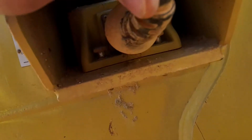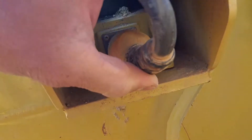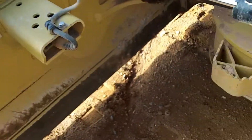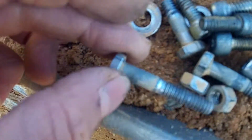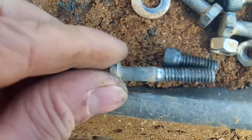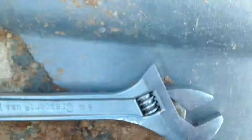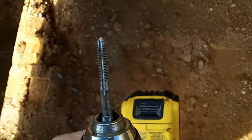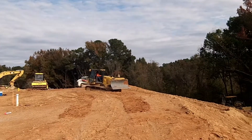Right now it's sitting flat, so that's interesting. We'll fix that for them, then we'll figure out what the GPS issue is. They boogered it up a little bit — those holes are aluminum. They used these instead of these, which aren't even the same thread size; this one's a little bit bigger. Let's see if I can re-thread it.